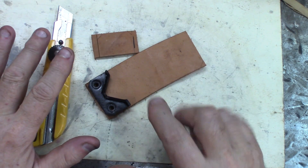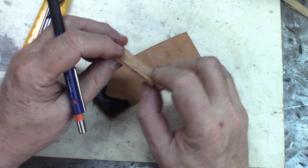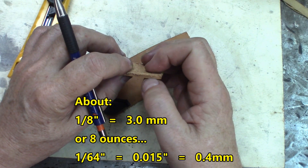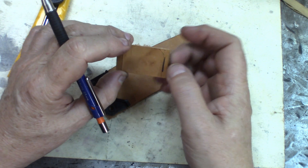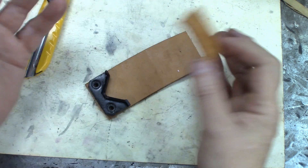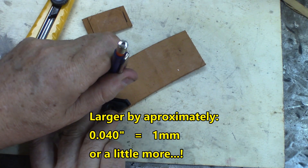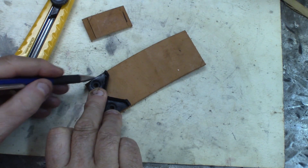Here are a few of the tools you may need to accomplish the job. This is leather — about 2 millimeters thick, about 8 ounces. Every 64th of an inch adds up to be an ounce on this kind of leather. You can get some old shoes, a belt, anything that's leather. Ideally this is new leather, but it could be just about anything. Do the cut — just make it a little bit wider than the wipers themselves, using the old wipers as a model.